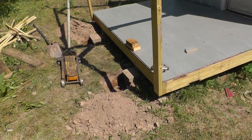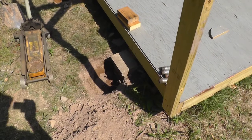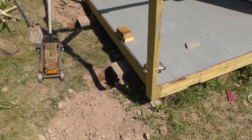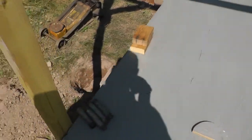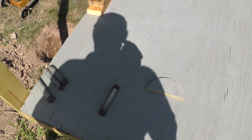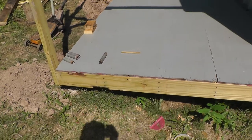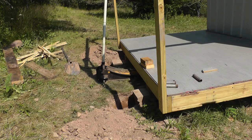I've got a floor jack and these back blocks that are buried. I've got them dug out behind so I can move them back. I can't just slide on them because I used the 10-inch blocks with a notch in them and put the 4x4s up against the notch, so in that respect it worked against me. But we'll get her — I'll get this end jacked up and I'm going to put one of these under each one: a piece of three-quarter inch pipe. Jack the front up and do the same, then hopefully we'll be able to push it back, lifted off all the piers in the middle, and just set it back down. That's the plan.